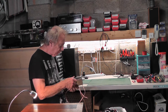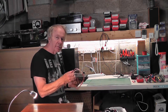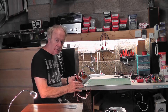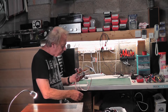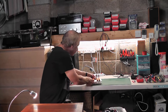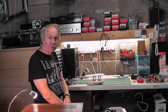It's still a little bit warm because I had that amplifier on full whack. But it's a useful device for fault finding and soak testing amplifiers. If it's any more powerful than that, I would need to make up a 100 watt one with a little bigger heat sink, maybe with a fan. But for purposes of that amplifier and for a couple of hours' test, it did the job absolutely perfectly. And it didn't cost an awful lot to build — around about 20 pounds all together. Hope you found this interesting, and I'll talk to you again soon. Thanks for watching.